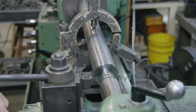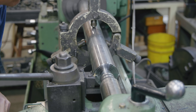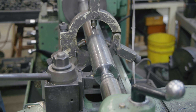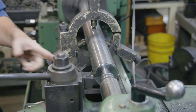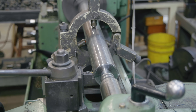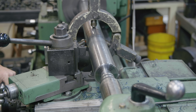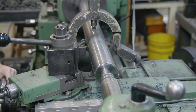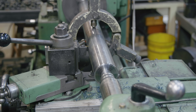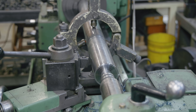I think we are ready to start turning. First thing I want to do is touch off on this end, just barely, and call that zero. I'll zero out my digital readout because I want to measure in that 10.375 inches. I'm dialing my carriage in, looking up at the digital readout, approaching 10.375 right there. I'm just going to make a mark on here — that gives me a visual reference of where I'm turning down to.